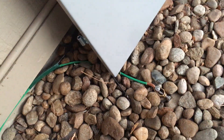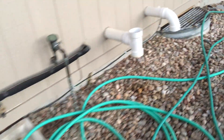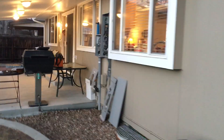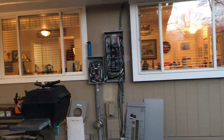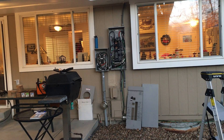Let me show my ground rods quickly. One rod there — we lowered that below the cement and covered it; they can put more rock over it. My second ground rod right here came in with number four copper to the basement where it was unfinished. In an overall scope: this house is about 45 years old with a very small split bus bar panel. We upgraded it and changed from 150 amp to 200 amp, got our permits, and all that.